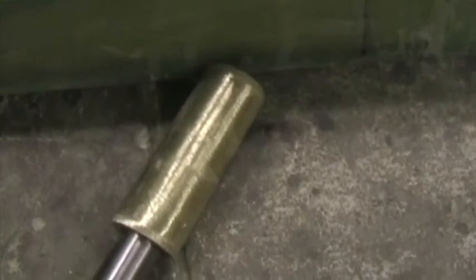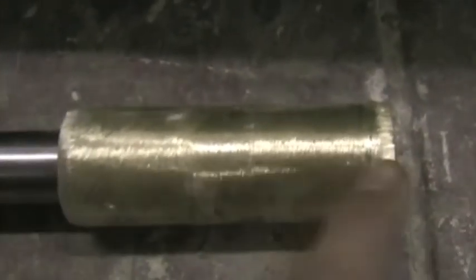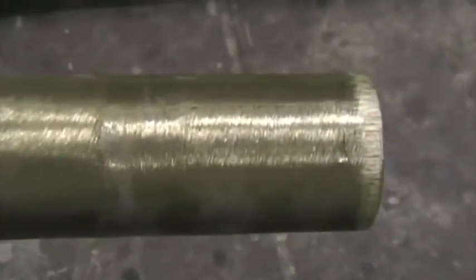These bushes have also been shortened to suit the aperture in the carry through spar. This one measures 105 millimeters from interface to interface of those bushes. So I've shortened the bush to 105 millimeters. From there to there, 105.